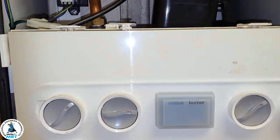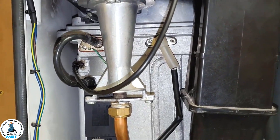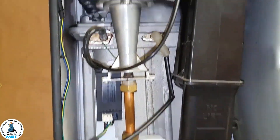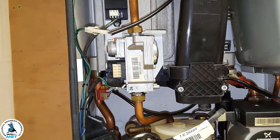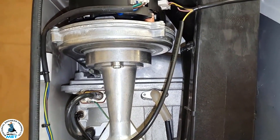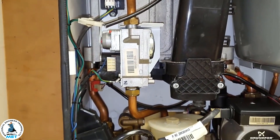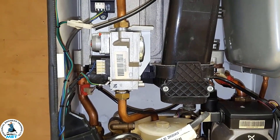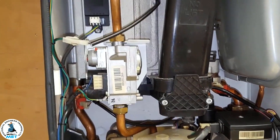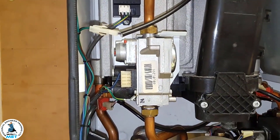Final question — are there any telltale signs about the burner that may be causing the L2 lockout? It's process of elimination. Go through the trap, gas valve, and so forth. Once you've exhausted all those, what's left is the burner, which could be a problem. When burners are damaged they're usually noisy — they usually make a humming, high-pitched, or groaning noise. That's a telltale sign of a burner issue, but you'd check the gas valve and injector first.